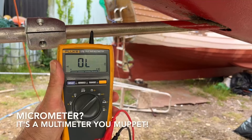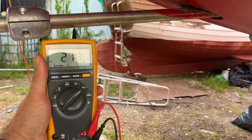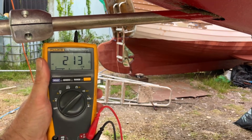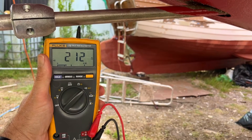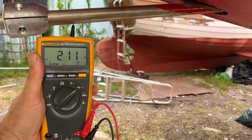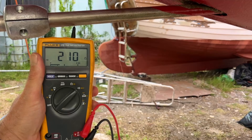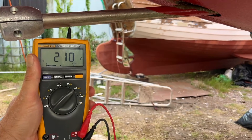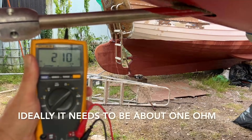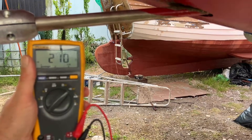What I've done is set this onto the continuity test, and if I touch the prop shaft you see it gives me a reading of around about 214 to 210 ohms. So it's well, it's clearly connected internally. The question is, I wonder if the wires are in poor condition — judging by that resistance I would expect it to be a lot lower than it is. It's quite stable so there's clearly a connection there, but I suspect it's not good, so we'll have a look inside and see what we find.